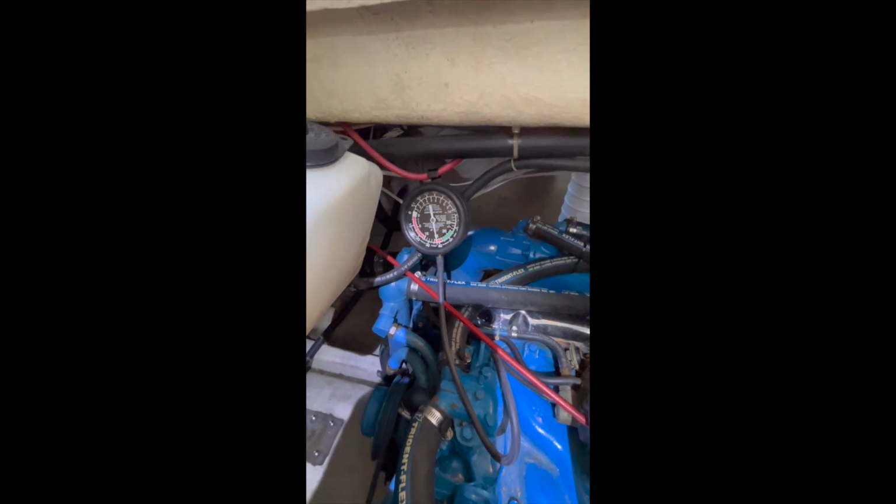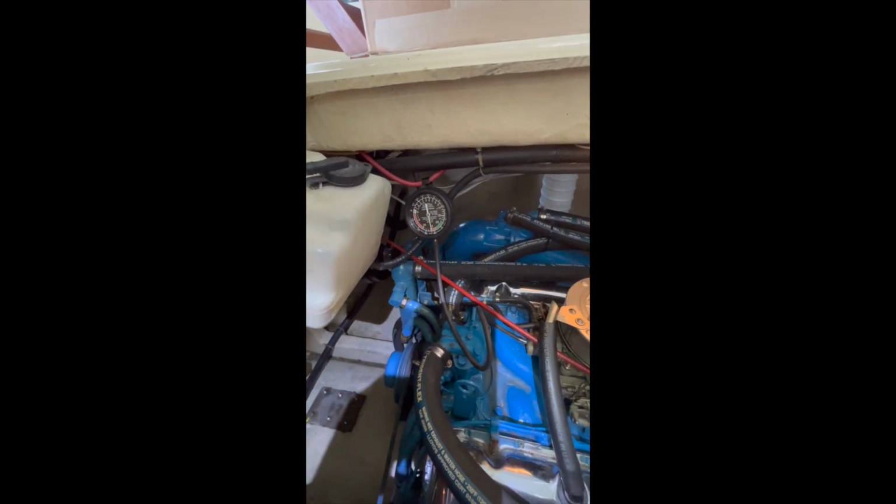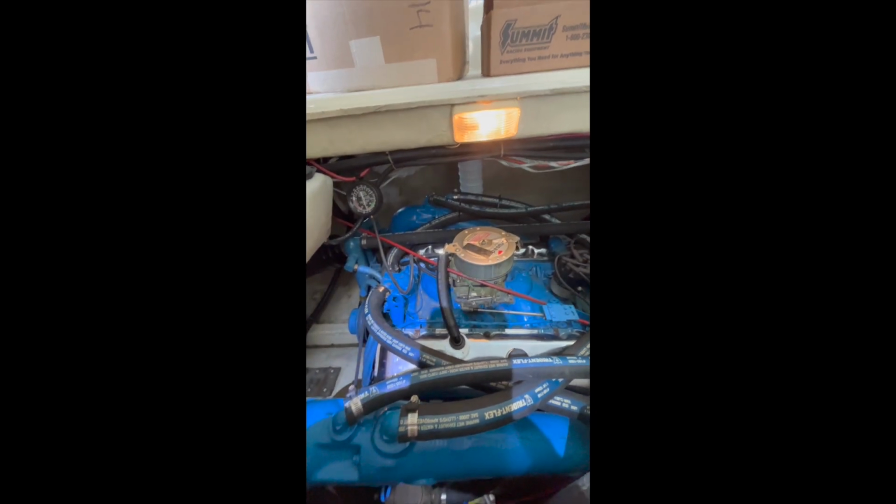And so then we thought, well, it must be coming from the carburetor getting too rich, because then I thought I was getting a leak in the intake. That didn't happen. Everything we did, this motor seemed normal, except the carburetor, and the carburetors wouldn't adjust. So we rebuilt the Thermoquads, and it was easy. Put them back in, and that made it a little better, but still they were fouling.